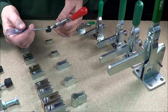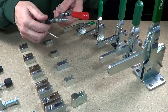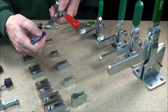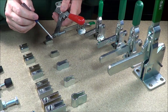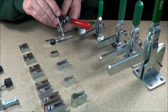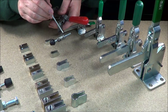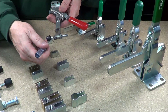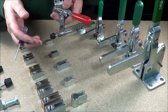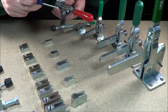Now some people will cheat and put just a little tack right up here, which lets you adjust it up and down, and then use this to tighten up. But what happens is you have this extra thread that sticks out the top. Well, you say let's just cut it off — but if you cut it off, you only have from the top to the bottom in adjustment before this falls out. So that's why some people leave it on. When you leave it on and you get weld spatter built up here, you can't get that off. Some guys actually have to cut them off, which takes a while with an extension cord and a grinder. So they're kind of just a pain in the rear end.